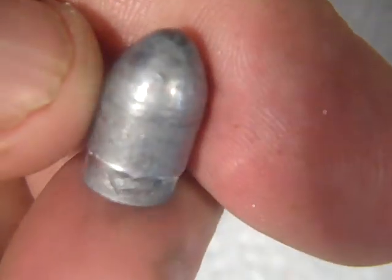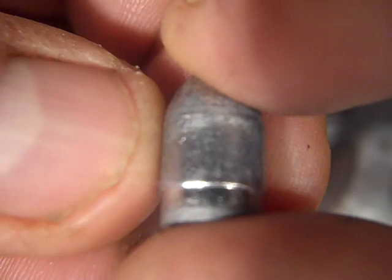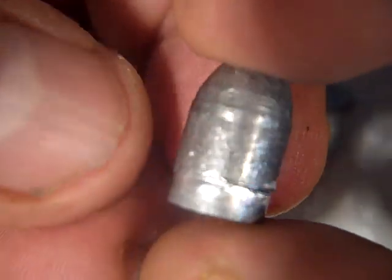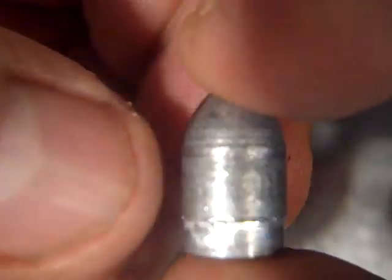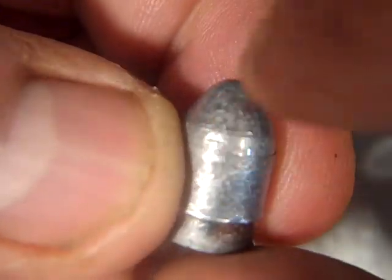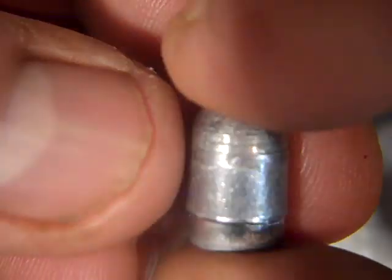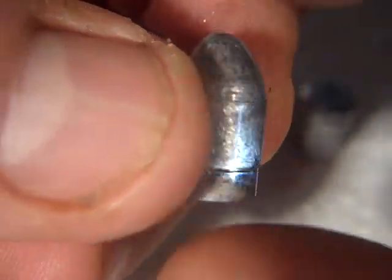This is a 150 grain. Same deal, but I made a mistake on this one. A little bit of the powder coat scraped off in a spot — right there, you can see where that's shiny. That's where the powder coat scraped off because it went into the swaging die cockeyed a little bit, and that's a reject. It'll shoot, but because of the friction difference between the powder coat, which is very slippery, and the lead, which is basically sticky when it goes down the barrel, that'll throw it off. It won't be accurate. So that's a reject.